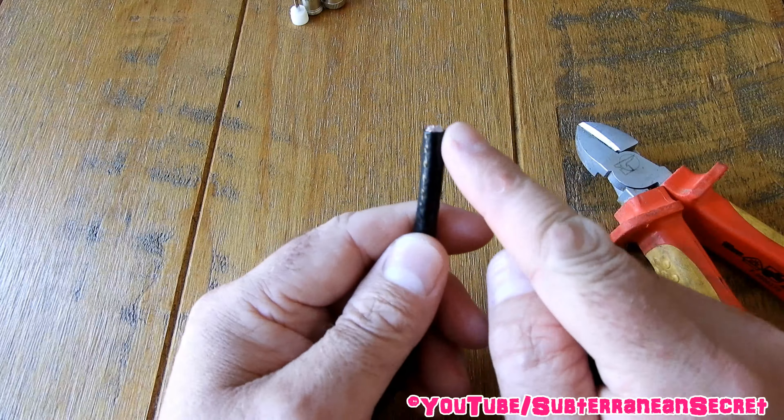If you've cut some of the little copper strands it doesn't matter. You can also see this foil which also protects against interference — this depends on the cable you bought; if it's a cheap cable it won't have foil. Once you get all the thin strands of wound copper, I like to separate them into two equal parts, pull them all away, and make sure any cut foil is pulled up as well. Once it's roughly equal either way, just spin them around into a kind of ponytail, then wrap them back around the cable.